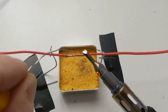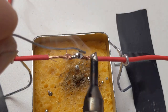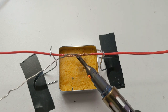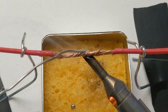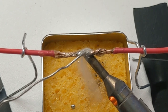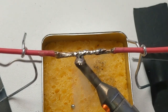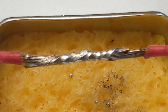The main thing you're going to want to do with soldering: rather than melting the solder on the tip and dripping it down into the wire, you're going to want to heat the wire itself up until the actual solder melts into the joint. Then just feed it in and the rest will do it all by itself. That's where the flux comes in handy. And that is how you want your solder joints to look.